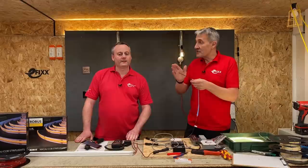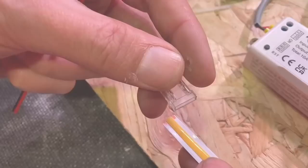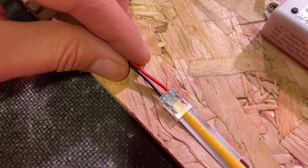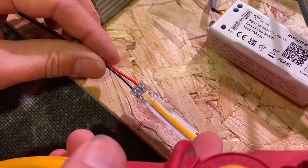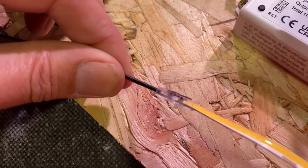So let's start by looking at how we connect to the IP20 version of the Macau LED strip. We've got our super nips and we're just going to cut right in the middle between the two solder pads. Then we'll bring in this insulation displacement connector — metal pins up and the yellow phosphor strip facing up. Bring in the PCB with our wires on that we're going to connect to the LED strip, and then it's just a case of punching that through the circuit board. We've got some plastic pliers to do that just to be gentle on the connector — a good squeeze and that actually punches through the circuit board itself.